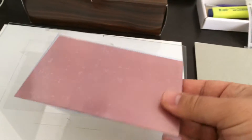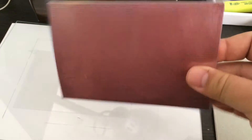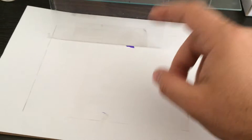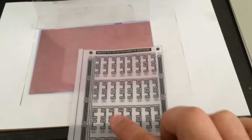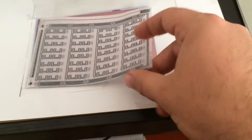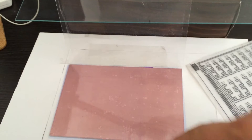Prepared a new board. This is with the photo resist on and ironed. Now all the shiny side up. I have a piece of frame and the template. This is the toner side and this is the back side — now I'll put it toner side down. I cut the film on the edges so it's nice and clean.